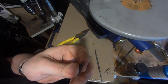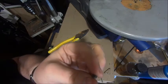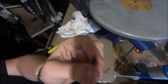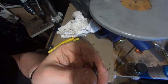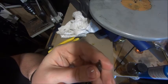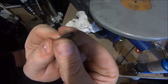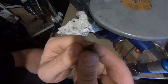All it needs now is a final sharpen. We're going to use the faceting tool again just to give that a polish up - a little diamond file or a ceramic file or something fine, a stone would be good, a little bit of Arkansas - just to clean this face and this face up. And he's ready to use. So there we've got - have a look - the final finish on there, and it's time to try him out.